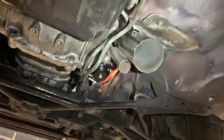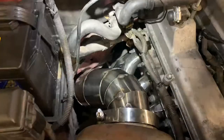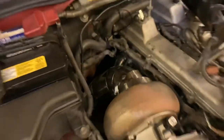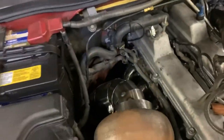Just got the last piece put on, and this is how our downpipe is going to look. It's beautiful — running just perfectly parallel with the dump pipe. It looks so good. It's not touching the body, it's not touching the dump pipe, it doesn't touch the headers. It's just routed very nicely. It actually turned out really good. I'm going to go ahead and start fully welding. Here's the top view — it just kind of snakes around and down. Not too bad. I stuck with 11-degree cuts on most of them; if I needed to go a little extra distance I just cut them a little longer. I put angles on everything even when trying to cut it straight, because it gives you more adjustment when you go to fit it — you can turn it a little bit and tweak the eccentrics. I'm pretty excited. I hope I don't ruin it with my welds. The welds are really bad in some places and pretty good in others, but from where I'm standing it looks kind of cool.